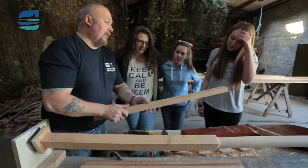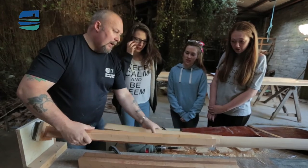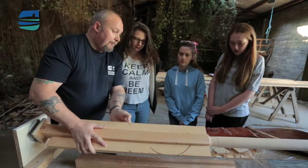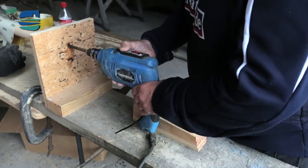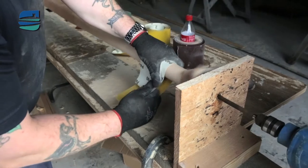This is the oars — these pieces will make up the blades, going on either side, and they'll be shaped to make the shape of the oar. The process we used for making the oars was to set up a bench with L-brackets on either end, put a metal plate on either end of the timber and connected it up to a hand drill, then planed down the excess timber and used the drill to spin the timber and sandpaper to smooth it off.